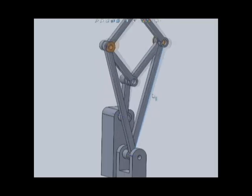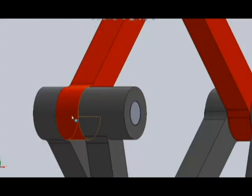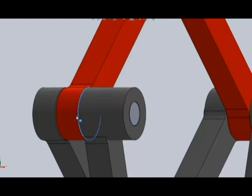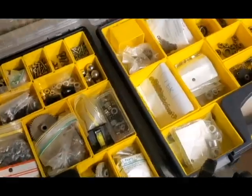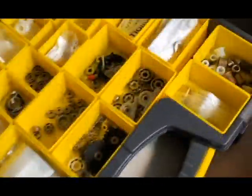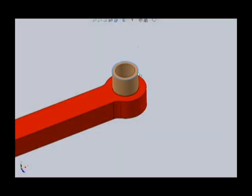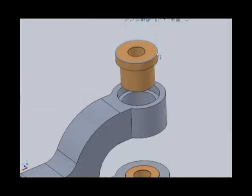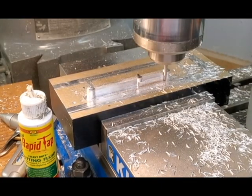I made a model on the computer back in 2015, and got back to it in 2023. I checked the joints so they would work as described and made sure there were no crashes in SolidWorks — you have to double-check that it doesn't have intersections and so on. Then I made it all so that links would accept bronze oil-lite bushings. The bushings go in when the parts get finished after anodizing. Then I milled the ramp parts the usual way on the mill.